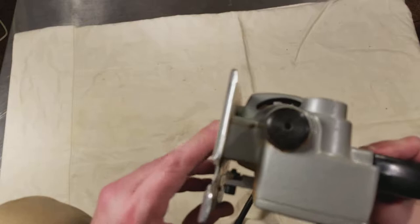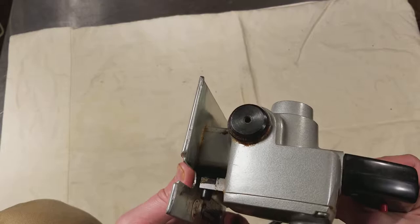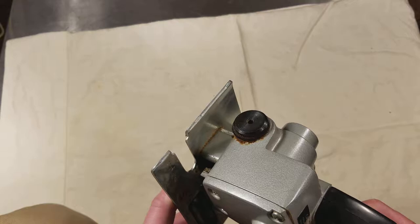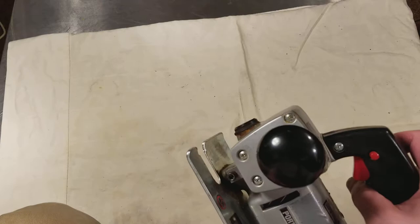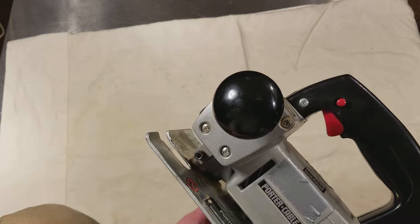It does have a forward-facing air jet — you can almost see it back there behind the blade — so it clears your cut area. It also has an anti-splintering insert if you're doing wood cutting. I primarily used it for wood cutting, but a regular jigsaw is just fine for that. This is made for much heavier duty cutting — continuous high pull force kind of work. That's why they're used so much for cutting sheet materials. You can get high-end blades and they will cut — I've cut half-inch steel with these and it's just excellent.